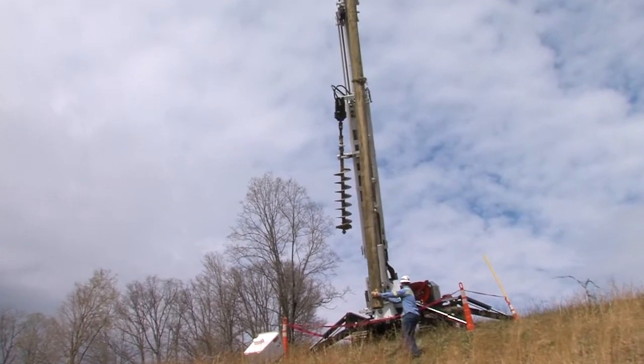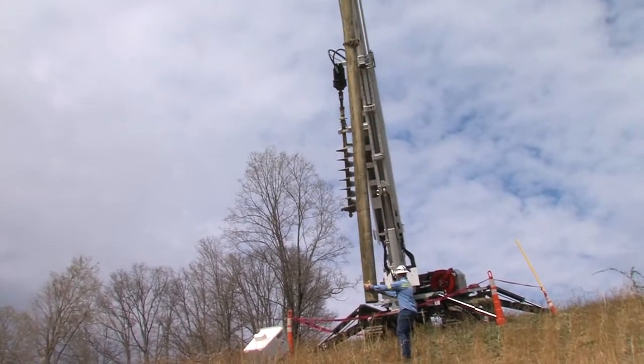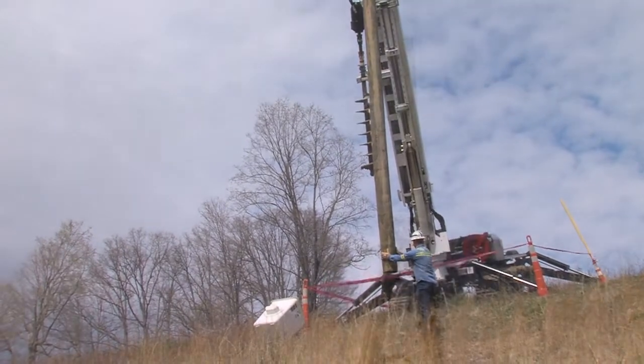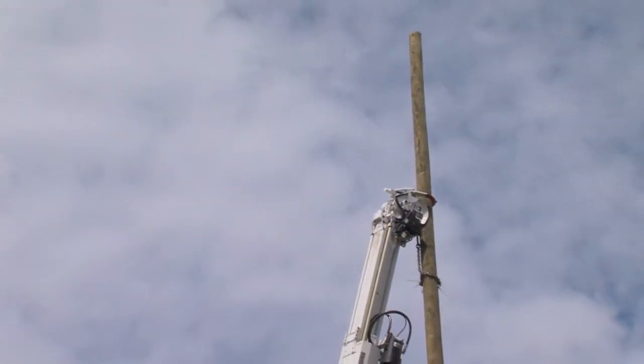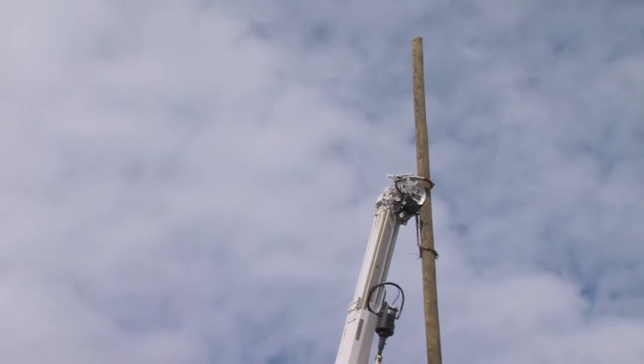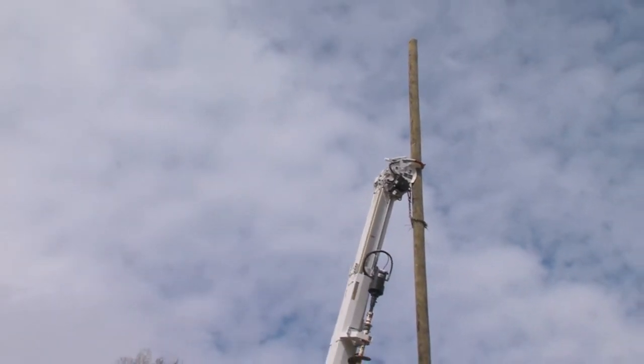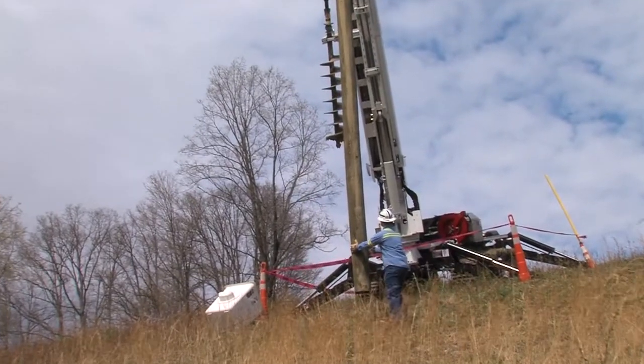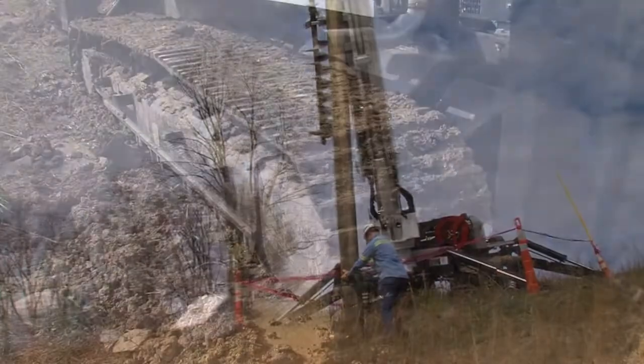Rotating the boom in its lowered position can cause damage to the hydraulics and rotation gear if the boom runs off. Raise the boom to its most vertical position. With the load over the machine, rotate the boom until it aligns with the work location and lower the boom to set the pole into place.